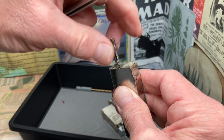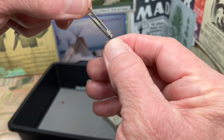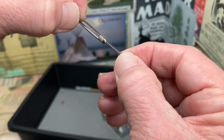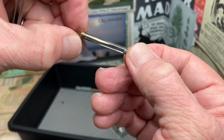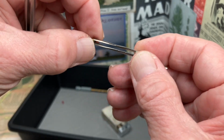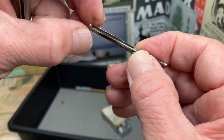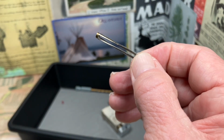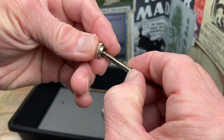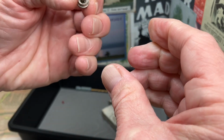The actual flint spring screw, or what's serving as the screw, is this little threaded insert here. So it screws in, and then this will push on up and out of the way. You can see that this one is somewhat damaged in the way that it has been twisted over time. But as I was saying, this knob, or what would function as the end of the screw, came off.